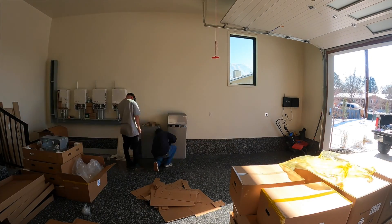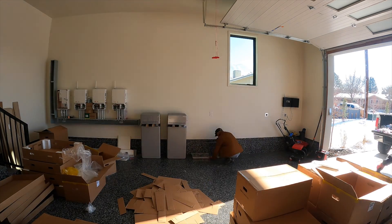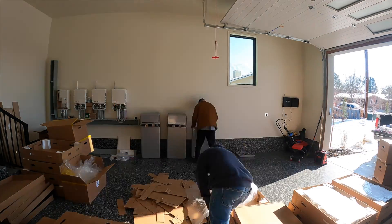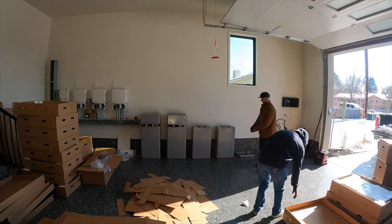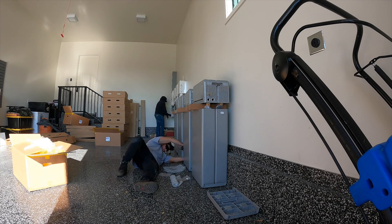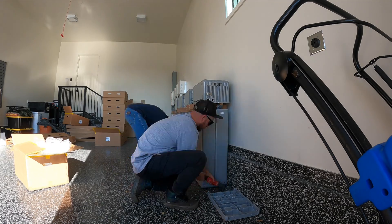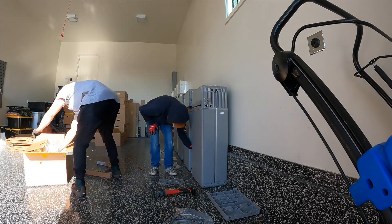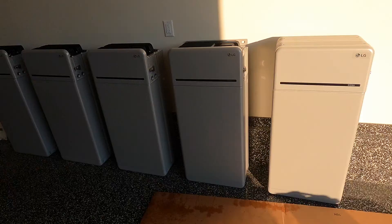We'll set you guys up on a time lapse to show what we're doing. Sam and I are setting up five of these LG batteries — this is the 16H Prime from LG. Before you start complaining, I know a lot of people don't like SolarEdge and a lot of people don't like LG, but I do. You basically have a bottom mount, two battery packs, a top portion, and a handful of screws. You can DC couple these LG batteries to SolarEdge inverters — it's a really easy, simple setup. You have 80 kilowatt hours of storage, plus the solar system with power optimizers. I think this product is really good — one of my preferred battery solutions for grid-tied hybrid systems right now.